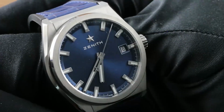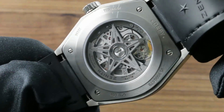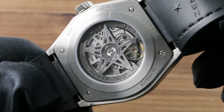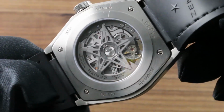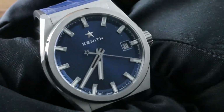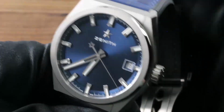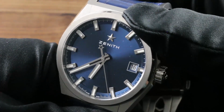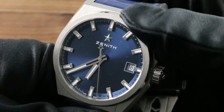And finally, water resistance, unlike a mechanical specification, is not a static feature of a watch. Over time, as seals age and lubricants degrade, the watch will be relatively less water resistant than when it left the factory or its last service. Therefore, Zenith recommends, at least on an annual basis, having the watch water tested, dry water tested, and this is a free service, at your Zenith factory service center or authorized dealer.